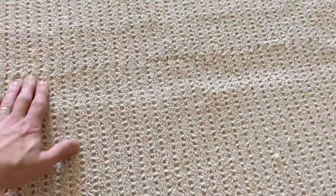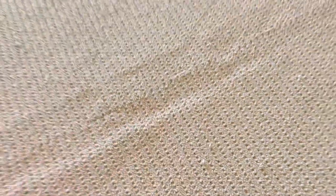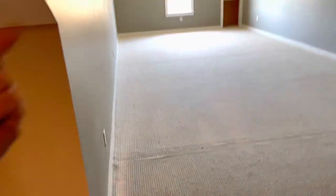We're going to tear this out and examine the seams. We are going to do that, and we're going to redo this. I talked to the carpet store. Last time I did this exact same carpet, I told him I do not like running carpet this way. We really got to start figuring running carpet the lengthways of these bonus rooms, because when you got light coming across it, that's what you get. You see stuff like that.